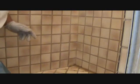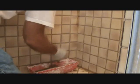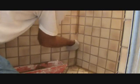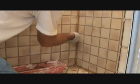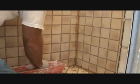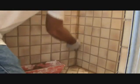Okay, I have some cracks, little hairline cracks here and there on this seam here. So I'm just going to do the same thing. Get over here with my finger and just put some up there. And I'm not going to be too concerned about just the areas where there was some missing grout. I'm going to do this whole corner. That way, if the grout color is slightly off, plus this is a pretty old shower. Some of the caulking or grouting is depressed a little bit, and so this will finish up this corner nice. Okay, there you go.